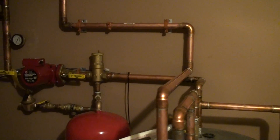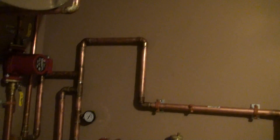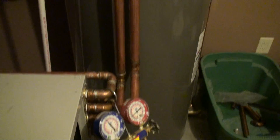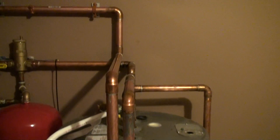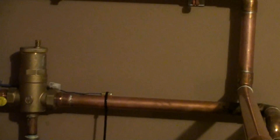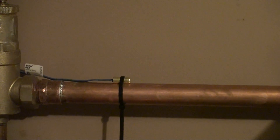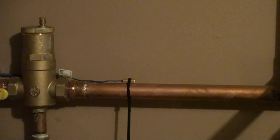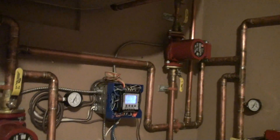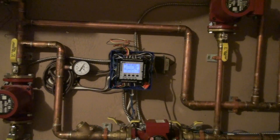This is the heat pump circuit here — this loop is the heat pump circuit, back into the tank, back into the heat pump. Circuit number one, heat pump circuit. There's a little sensor right there on this return line that tells the house control — which is this unit on the wall over here — what temperature is coming back.